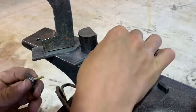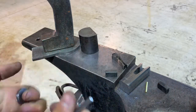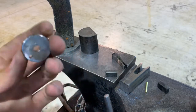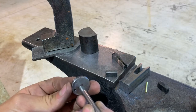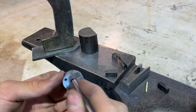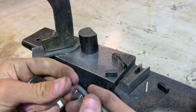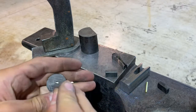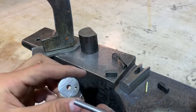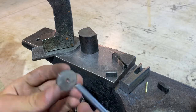What I'm going to do is — I drilled this hole here too small for this one on purpose. So what I'm going to do is heat up this, and then stick this in there, because this expands when it heats up. So when I stick this in the hole, it will, when it cools down, contract around the steel rod, therefore causing a very tight fit — sometimes tighter than even welding. So that should be pretty good.